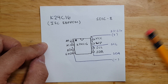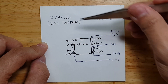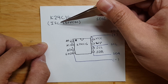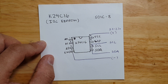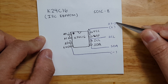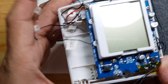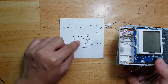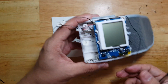After checking 3 different blood pressure monitors, I found out this is the exact part that they are using. This is a Chinese chip, similar to the Microchip I2C EEPROM but much cheaper, which is why that's the one they use. In this blue ink, these are the wires that we need to get out from our blood pressure monitor device. It's soldered there inside and we need these two additional wires.